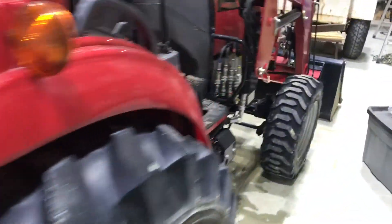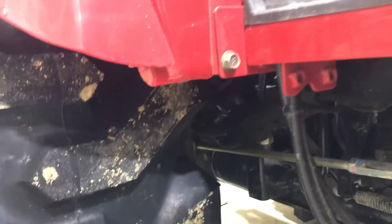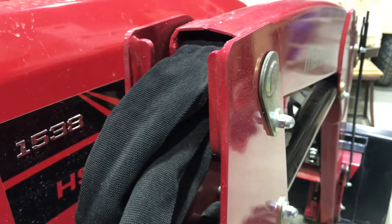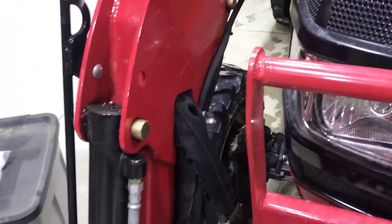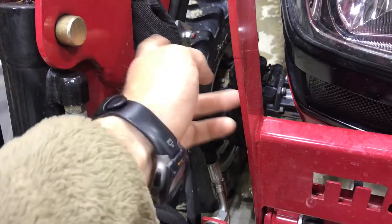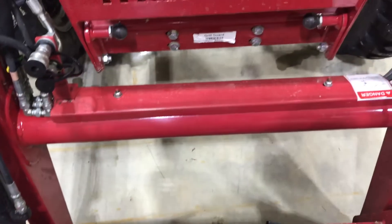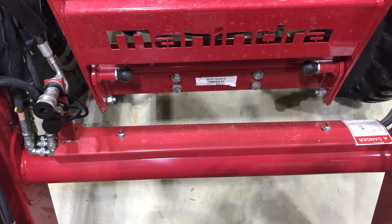As far as the plumbing, since my control valve is back underneath hidden away, the lines come up underneath the floorboard and I put 90s on them. I tried to run them as factory as I could — they've got the same wrap, go down the loader arm, and come out the loader arm just where the other ones do, then into this little bracket here that's welded on to the crossmember cover plate. Hope that helps — good luck.